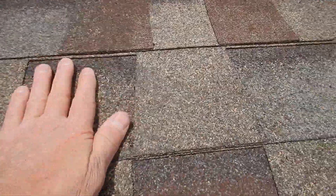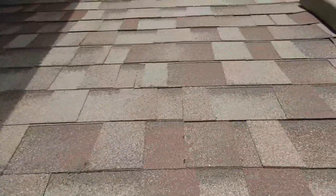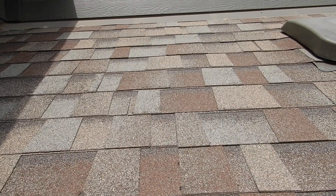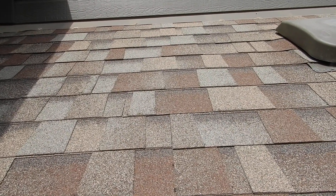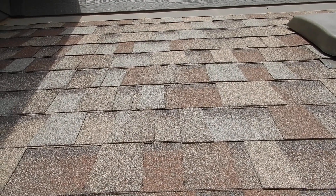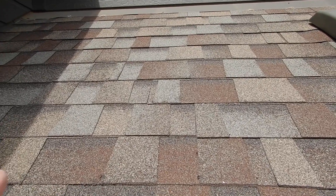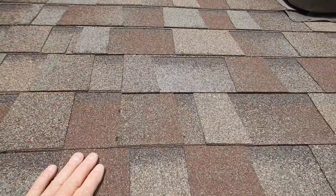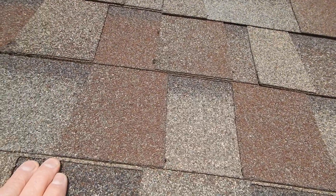One shingle on top of another shingle on top of another shingle. The underlayment underneath the shingles also cascades down. They'll put the first sheet, the second sheet, and the third sheet, so it works down. The seams on the underlayment will cascade like this, coming down off of the roof.